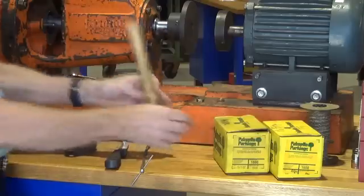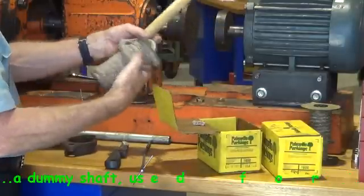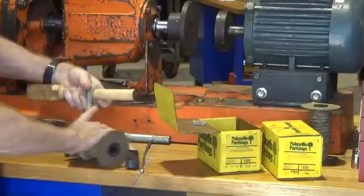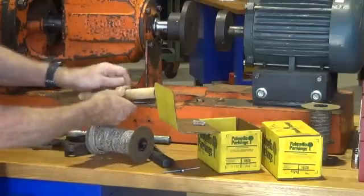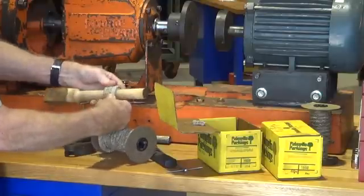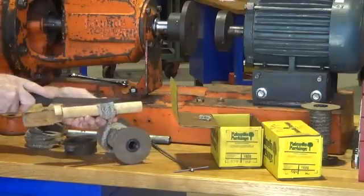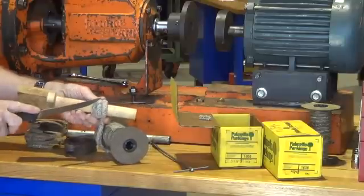This is a dummy shaft. I use this one when I am packing a valve gland. This isn't the right diameter for the pump that we are working on, so I will just use rounds of packing brought out of the pump to do it. This is a good way of keeping the rounds of packing nice and straight, square, and consistent so we do a nice straight cut. For a pump we want a straight cut; for valves, 45 degrees like that.